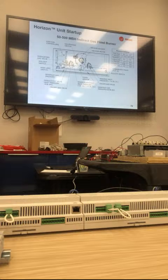Between the on-off and modulating valve, we asked for 5. Low fire is 0.5. High fire is 3.5. If you haven't seen one of these valves before, they're pretty simple to use. You hold the button on the left, it'll light up, start blinking. That means it's low fire. You can adjust low fire by pressing this to decrease your gas pressure. Right-hand side increases. We've included the instructions.